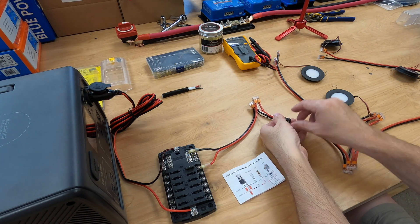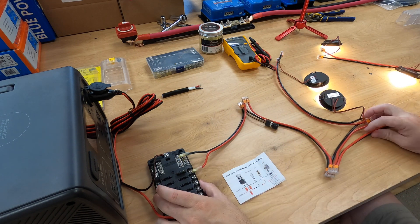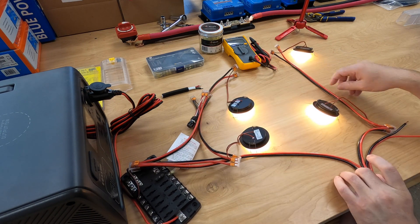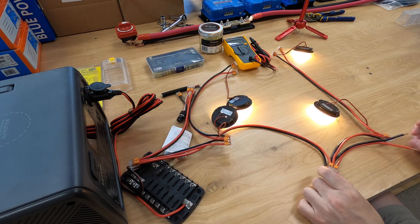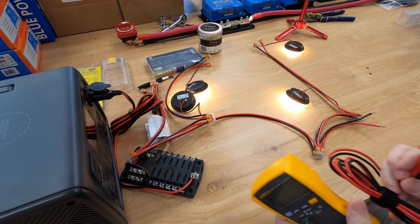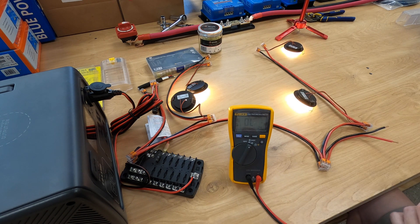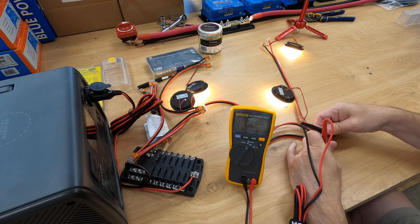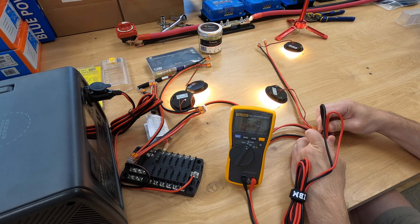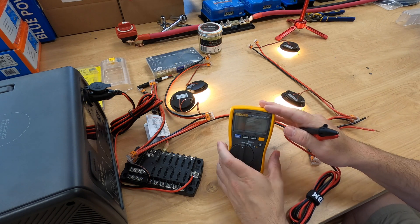Let's turn this on again all the way — I'm going to flip these over so I don't blind myself. They are quite bright. I said I would tell you the voltage at the end of the row here. I did leave three-prong lever nuts so I could show you that at the end, because I've chosen an appropriate gauge wire and still have good voltage all the way through my circuit. Holding it steady — 13.18, 13.19 volts, bouncing around. These pucks only need 12 volts, so we're good to go.